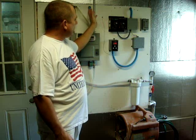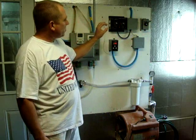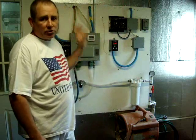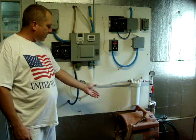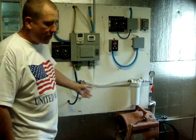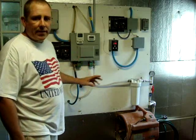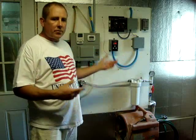This is just a cycle timer — we keep it set to run for about 15 seconds every 15 minutes when we are using it. We're no longer using this either. This used to be a variable control for one of our exhaust fans that we ran constantly. We now have a squirrel cage floor fan down here that we're using for an air return system. The air comes out another vent in another part of the room, cycles back down through here and back into the grow room, creating a constant airflow. That's another reason we're not having to use the air exchange system, because this fan is also pulling in some fresh air from this room into the system.